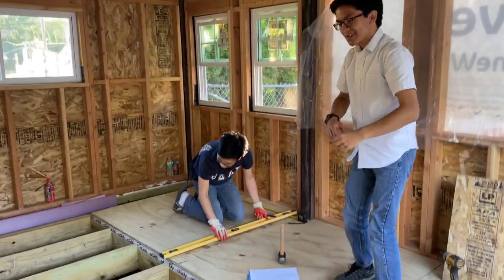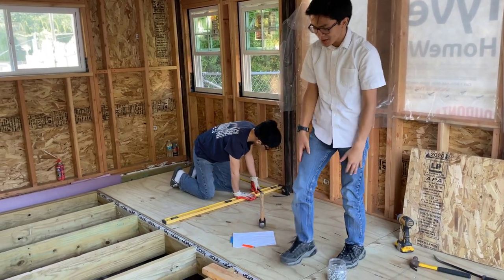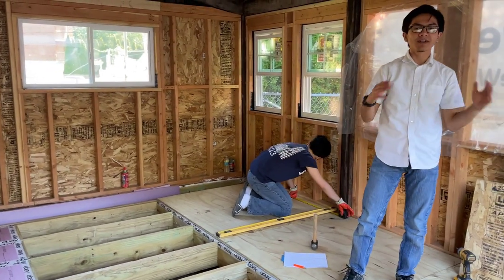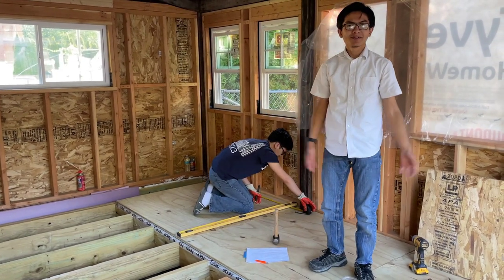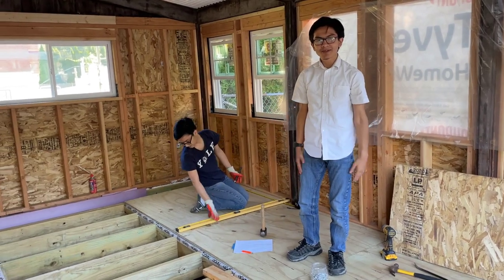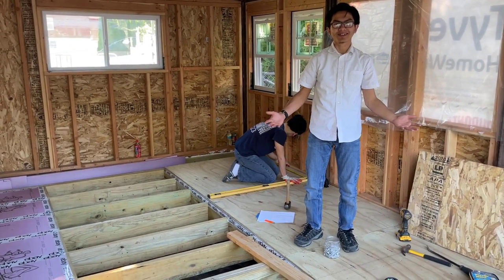I guess that's not really accurate to what I'm saying, but in our case, we actually have more strength than is recommended by code. The way that we're doing it, especially with this double joist, this sister joist, and everything else that we've accounted for, with all the different methods like the blocks, we actually have more strength than is recommended by the code. So, who cares if you put sheets 4 corners together? We're not going to stagger them, we're just going to install them, I guess, parallel to each other, like the way that a checkerboard looks.